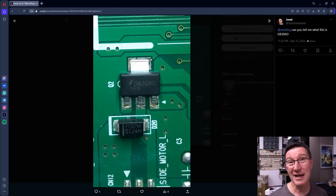I can tell just by looking that this is a SOT-223 package, but we shouldn't need that to help find the part. The next thing I notice is this F symbol here. Anyone old school will know that F symbol is the manufacturer's logo — that is classic Fairchild, one of the original OG manufacturers of semiconductors. So I know this is a genuine Fairchild part.